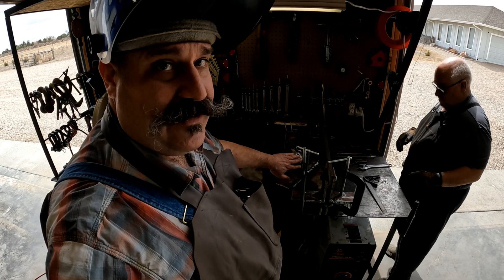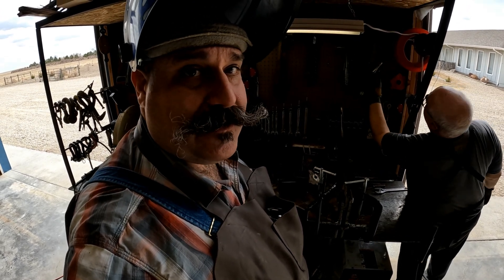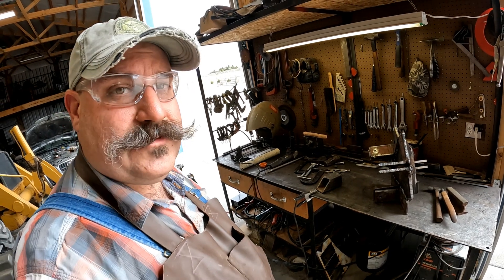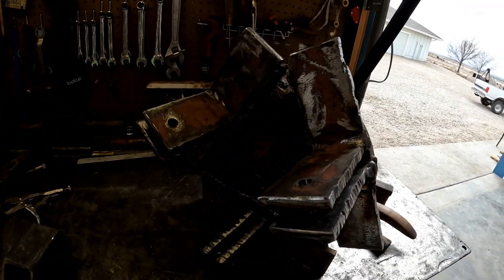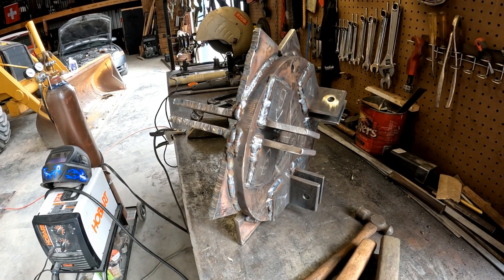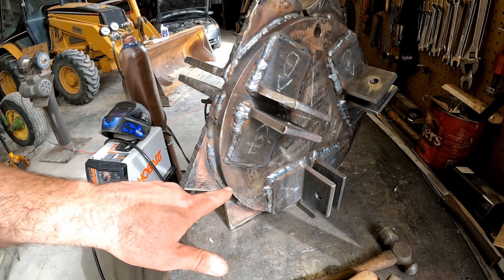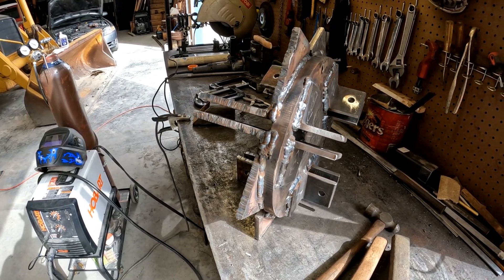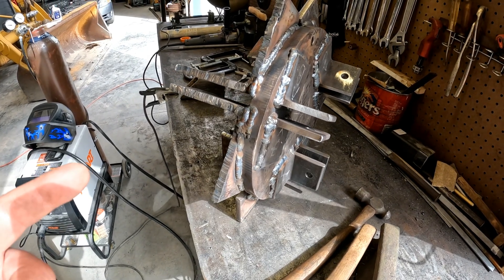Don't look at those welds — I've actually thought about blurring them out, they're that bad. I got lazy with the MIG welder. There was a time I could do pretty well with the buzz box, but today's not that time. We got super frustrated with the arc welder, and I actually made a ride to town to get some MIG wire so we could finish this up. This has turned into quite the Frankenstein of a puller, and there's a few pounds of weld on this thing. Our suspicion is that this plate being AR400, welding mild steel to it, rod that's been sitting in the cabinet for who knows how long, and the fact that I got spoiled by having a MIG welder — I need to practice with the arc welder quite a bit more.